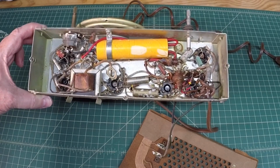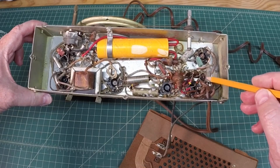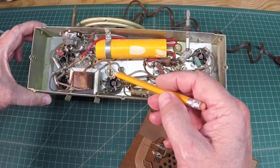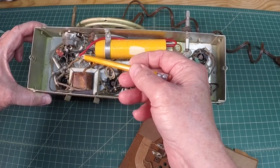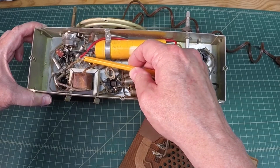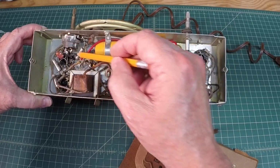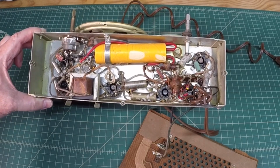and some of the capacitors have been replaced. You can see here. Possibly this has been restuffed, this electrolytic. But doubtful, but most likely replaced, because check this out. Look at this workmanship. See what I'm talking about? Just a floating connection point here, and you can see how sloppy the negative ground is here. But definitely work at one point underneath the chassis.